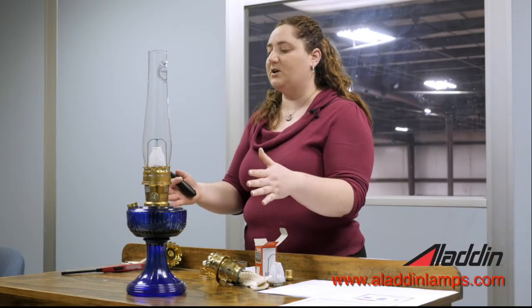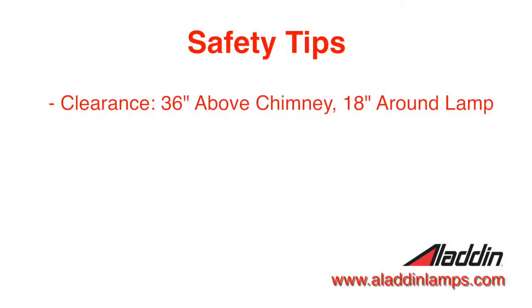Safety, always important. So our clearance around our lamp, 36 inches above the chimney and 18 inches around. So you don't want to have any combustibles within that range to keep it safe.